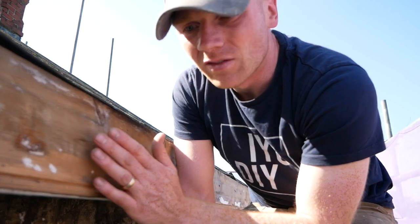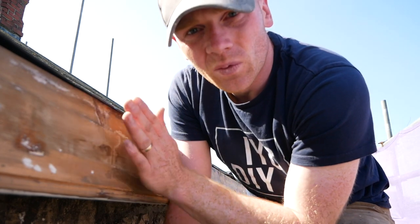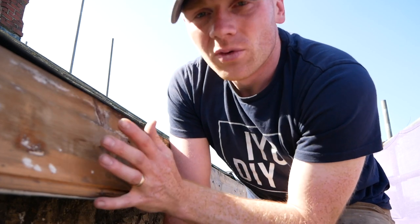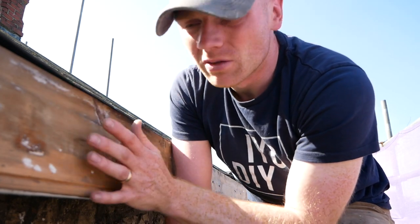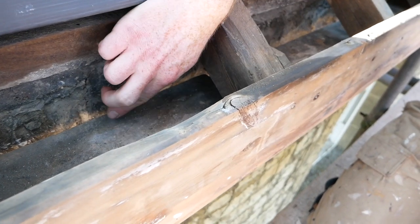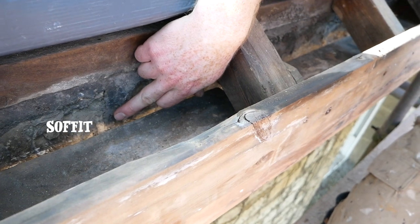And then I started looking into breathable wood paints, like there's a linseed paint which was recommended to me. And all that is fine, but there's some issues with retaining these. Now because of the way a roof is vented, you need ventilation. At the moment, the ventilation is simply provided by a 1-inch gap at the back of the fascia. That's effective and it's continuous, but it's also sparrow size and bug size and all sorts of creepy crawly size, and it's not the best way to do things.